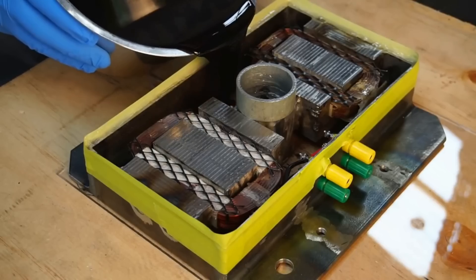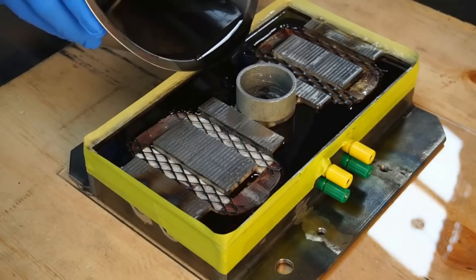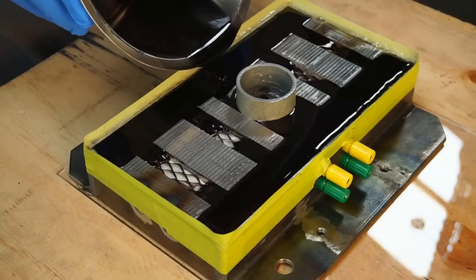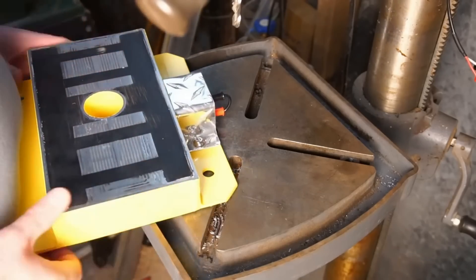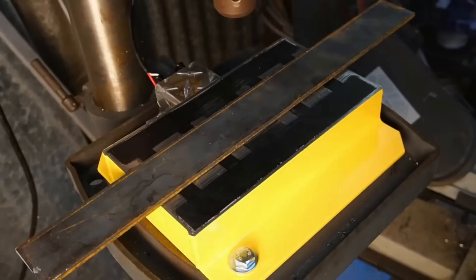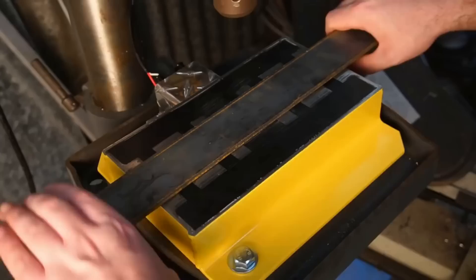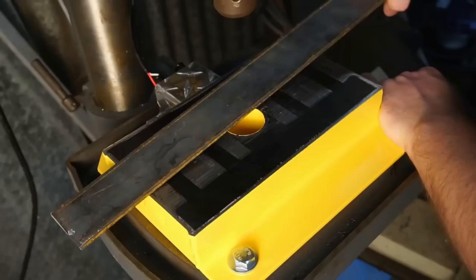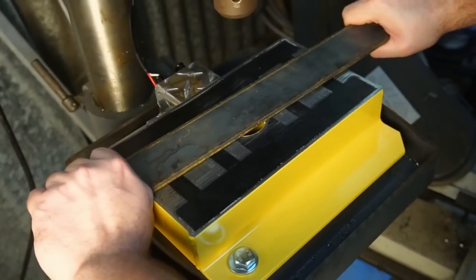There is of course another option — the electromagnet. You see lots of YouTubers using transformers as electromagnets to create a magnetic chuck. That's not really a great idea because if there's any failure or you lose power, you lose the chuck's holding capability and you have metal flying across the workshop. The benefit of permanent or electro-permanent is that once you've made that physical change or that pulse, it stays in that orientation — so if power is lost it doesn't matter and the chuck will keep holding.